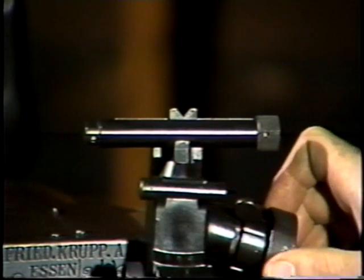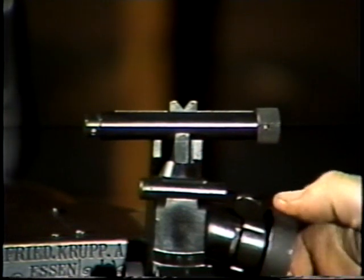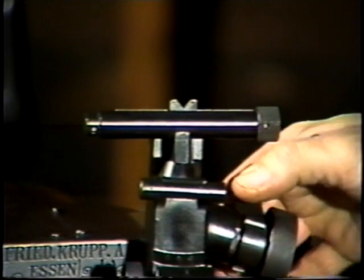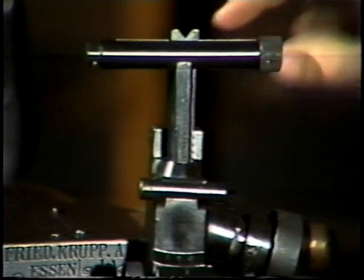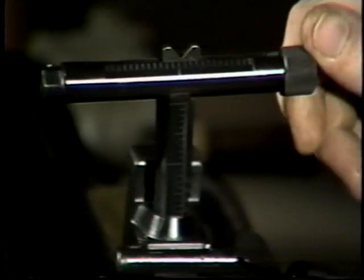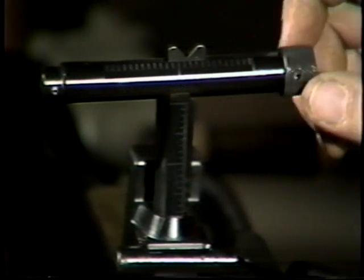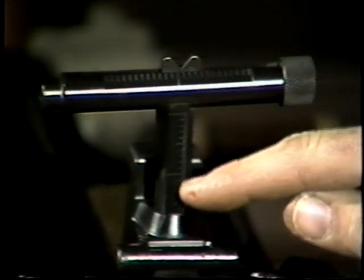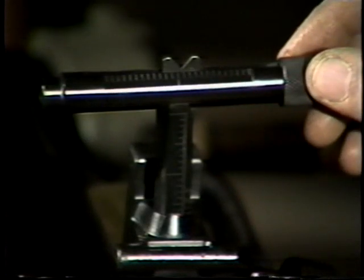On the right-hand side of the sight base is the elevating screw, and on its spindle is a throw-out lever that allows rapid changes in elevation to be made. This screw is used to put windage to the rear sight aperture. Both the rear sight staff and the crosshead are graduated for adjustment.